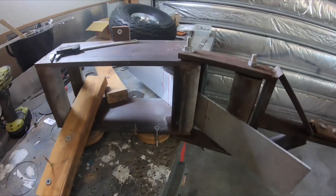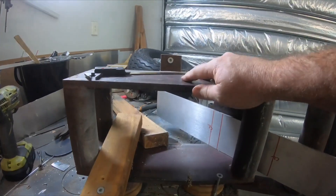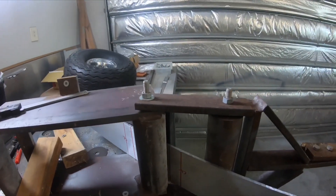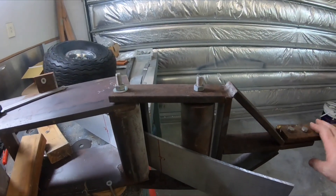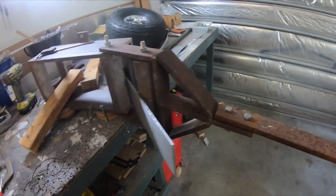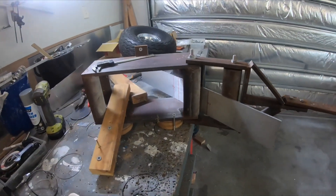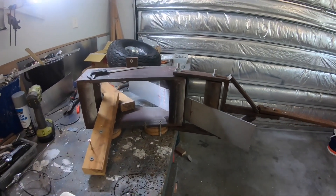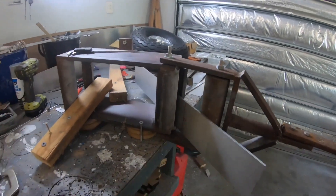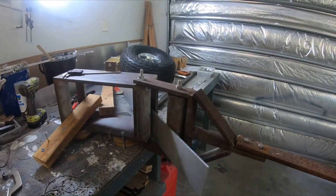I've kept it for future projects, so it's only made out of scrap steel. This is 12mm plate, 60mm diameter solid bar, so it's really heavy duty. This is all plate here too. It's all a bit rusty because it was actually like that when I built it — I bought all this steel from the scrap yard and it was sitting out in the weather. I only needed it for one bend, so I wasn't going to spend a fortune making it. I just welded it all together, made sure it was all square. The bolts are the hinges and it just pulls around and bends a nice 30mm radius on the plate.